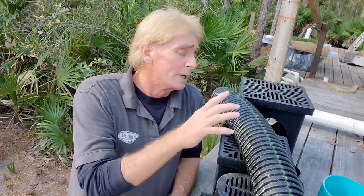First let's review what a French drain actually is. A French drain is perforated pipe surrounded by an aggregate, whether it be gravel or — some people like to use the Easy Flow. I like to use the Easy Flow; I think it works great. It is a perforated pipe with an aggregate around it. You can use slotted pipe or a pipe that has holes in the bottom, because as water rises up in the ground, it will go through that aggregate into the pipe and be carried away.